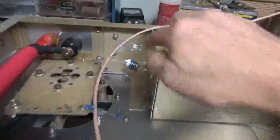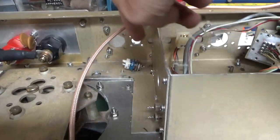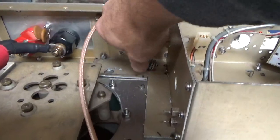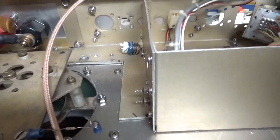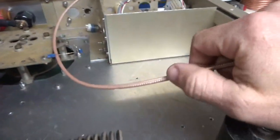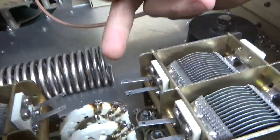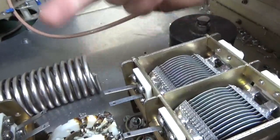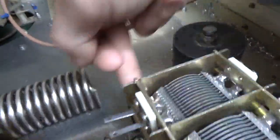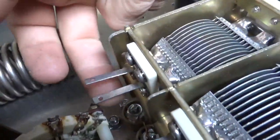I'm going to mount an SO-239 over here in this hole for the input. I'm going to punch a hole over here for the RJ-1A for the input switching. Nice short lead length from the connector over to the common connection on that relay. I'm going to run Teflon RG-400 from the relay and secure it so it comes over this way and connects over here to this tuner for the input circuit, this air variable capacitor. I'll ground it down here with a solder tab and also put a solder tab over here to hold it in place, and then the hot will connect over here — and these are in parallel.